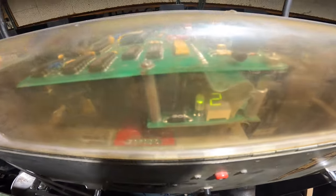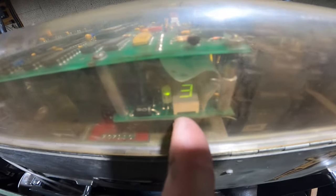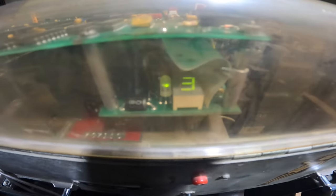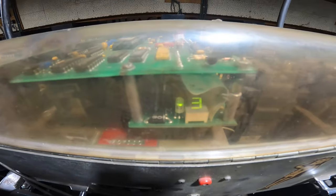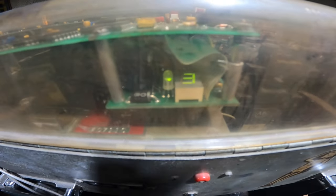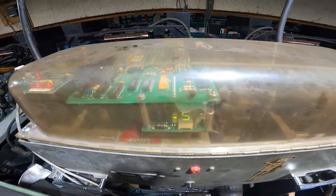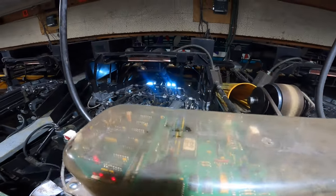With the S and T switches off, you can see it moved to step three. Step three indicates that the table needs to run, so when I turn the switches on, the table will go down and pick up the pins. Step four is the sweep sweeping the pins off, and steps five and six are the table coming back down again and the sweep going up. So the table goes down at step three, the sweep runs at step four, and at step five the sweep is back at guard position.